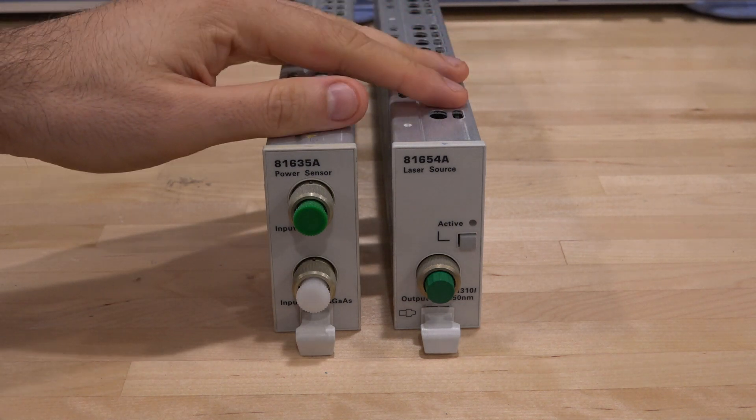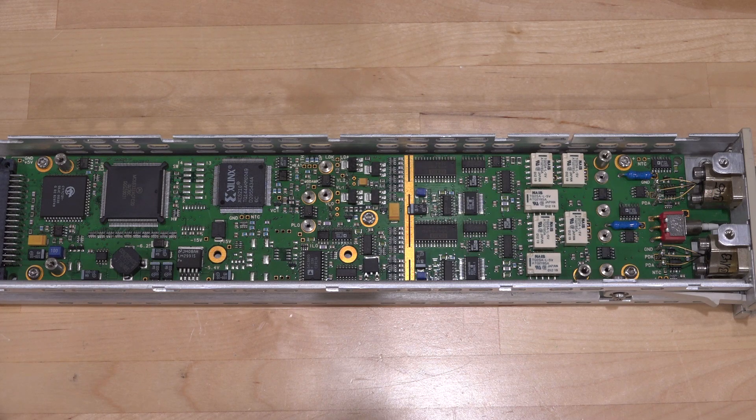Since we didn't do a very exciting repair, I'm also going to take these apart to show you what's inside. Inside our dual detector, on the right side you can see the individual detectors, individually serial-numbered and calibrated at the factory. The connections from each detector go directly onto the PCB. The function is really straightforward: you need to bias these photodetectors, and depending on how many photons are coming in, the bias condition changes. Those photons convert to electrons and produce some current that you measure. There's a complex loop with biasing and measurement simultaneously. Because these diodes measure a huge dynamic range — something on the order of 90 to 100 dB of change — you need ranging, and it looks like some of that is done using relays rather than purely solid-state, probably to maintain linearity and excellent isolation.